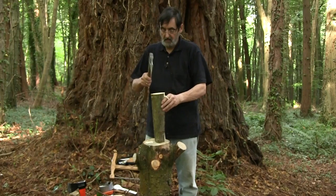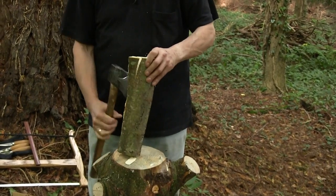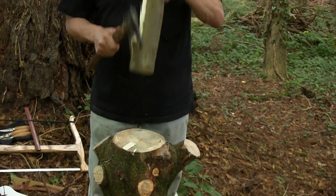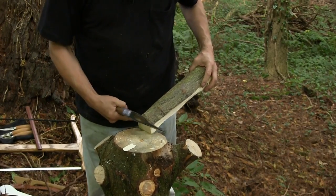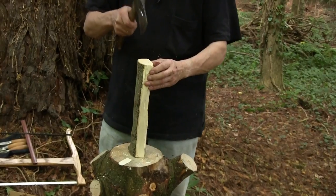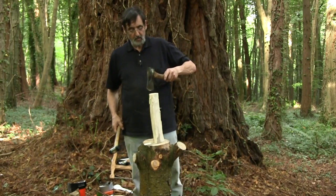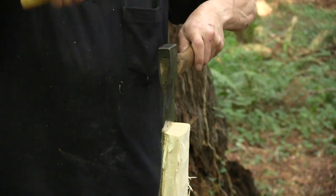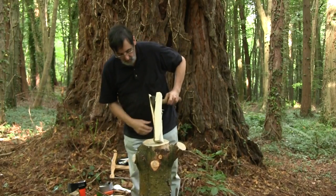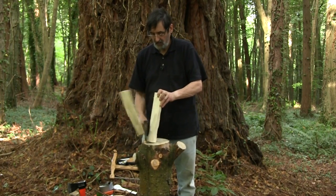This wide end is where the bowl is going to go. I can just weaken some of those fibers — see how that advantages everything. There's a knot here, so this is my spoon bowl end and this is my handle end. I might go in here and thin this back off a little bit. The thicker the tree, the more resistance you'll get to splitting, so when you get thinner hopefully we can split down some of this and get rid of some of the waste and excess.